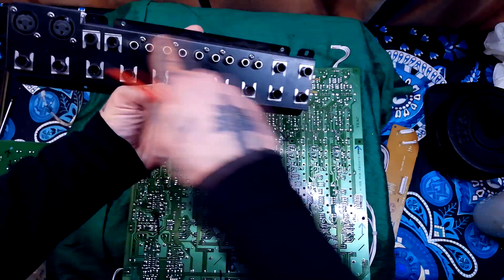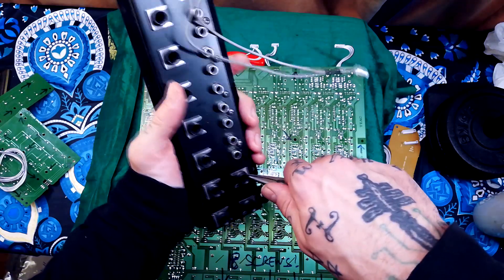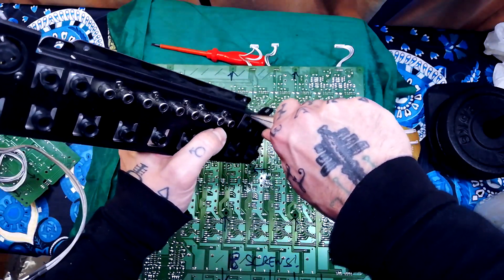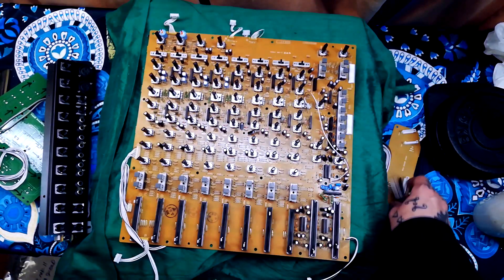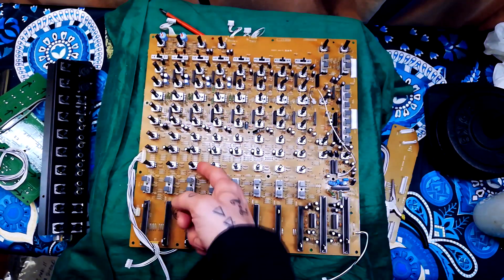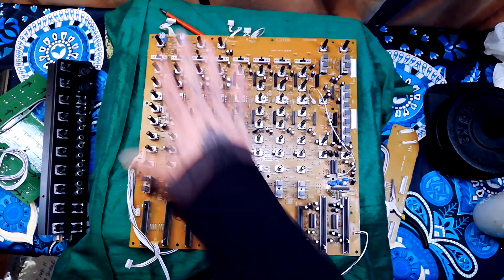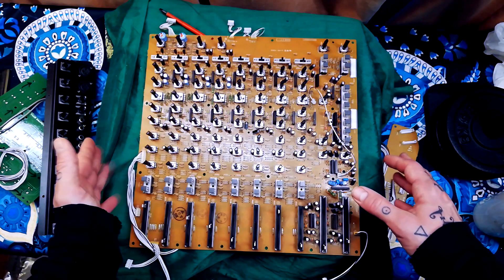Should you need to solder or trace anything on these socket boards, they detach via screws and clips. The clips pull off and when putting them back on, make sure the sockets are flush and slide them on. At that point you'd have access to the mixer board to solder, apply contact cleaner, compressed air, or suitable fader lube — I use Deoxit products — to give it a deep clean if needed. In the next video I'll be taking apart the lower section of the 488 Mark II.